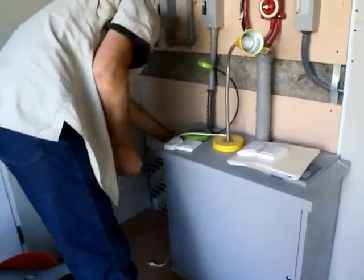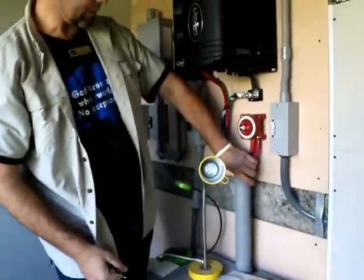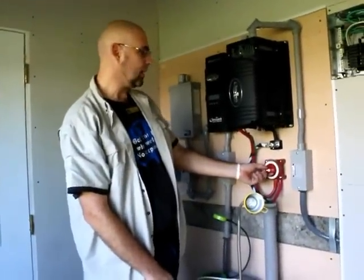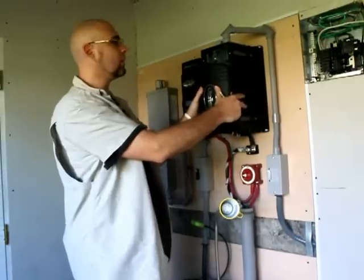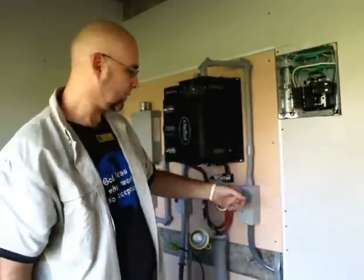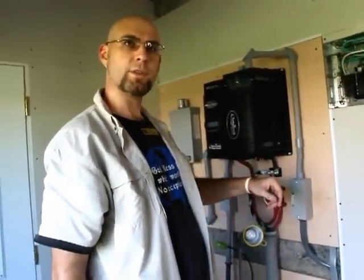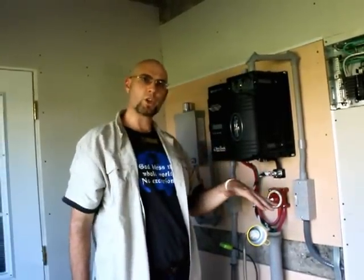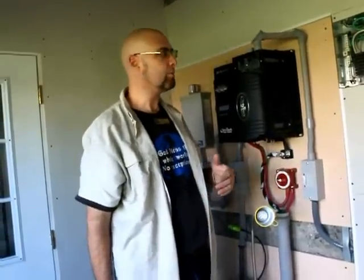There's a bunch of big batteries in here. Those batteries come out here into this big cutoff switch — we'll have two battery banks, and when we plug them in together I'll be able to switch from one bank to another or feed off of both. This goes to a really nice Outback inverter which converts this to AC voltage, just like your household current. In turn that goes to a sub panel, and we have a cutoff for that as well. There's safety all along the way, and we tried to build this to code even though we're on a trailer and don't necessarily have to.